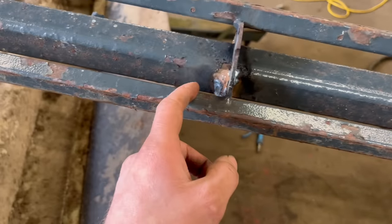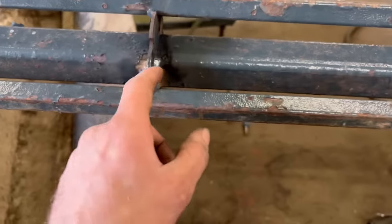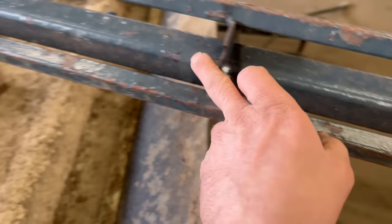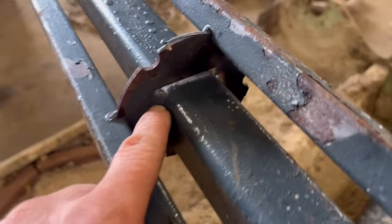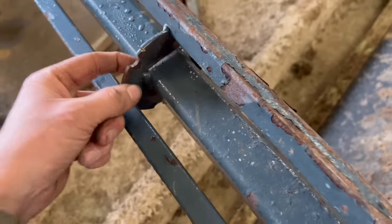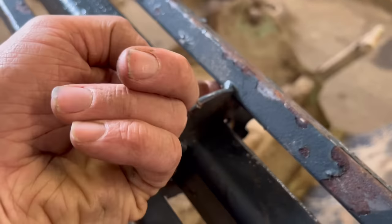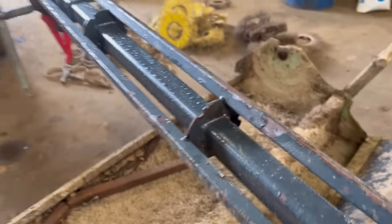It's not very nice to weld because you can't get in to grind the paint off, and the paint is in the gap. But you can see from new, it's only been welded, there's only a bit of weld there. Nothing on that side, nothing on there. Next weld is down there, so that's all it has holding them rings on. Well, that's not welded under there. It's only welded at one side, so there's hardly any weld that holds them together.